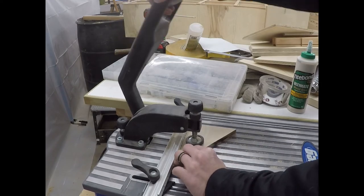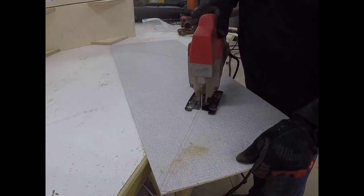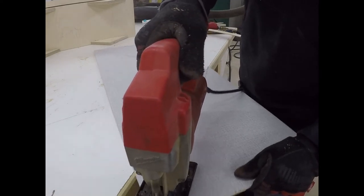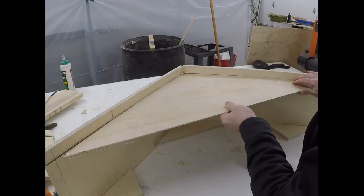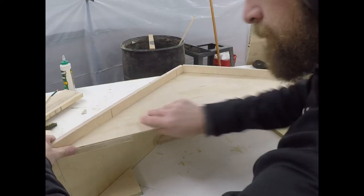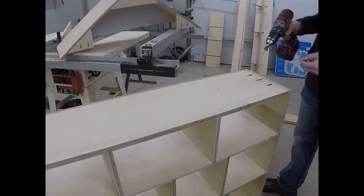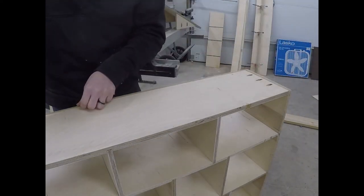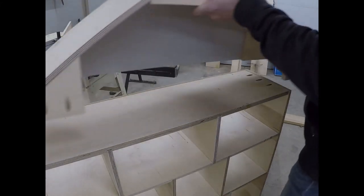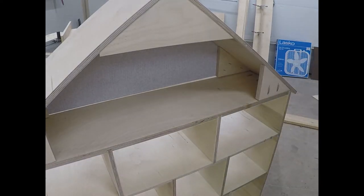To hold the roof boards to the top of the house, I take two of the triangular pieces I cut out earlier at the table saw and cut them in half, making four pieces. I take two of the pieces and put pocket holes on the back sides of them. On a piece of 1/8 inch plywood, I trace the inside of the roof contour, then add 1/4 inch and cut it out on my jigsaw. I slide the 1/8 inch plywood into the slot that we made earlier in the two roof pieces, then use my brad nailer to nail it to the triangular pieces fastened to the roof. To attach the roof to the house, I drill a couple small pilot holes in the front of the house — the back side of the roof will be fastened with some pocket screws. I attach the back with four pocket screws and use the pilot holes to attach the front with a couple 1-inch washer head screws.